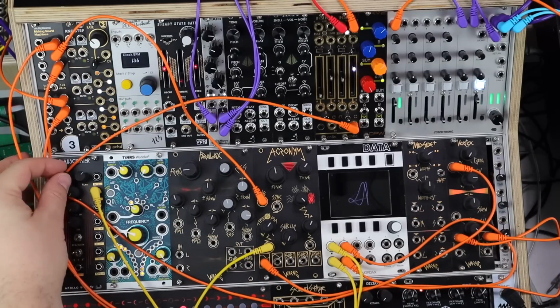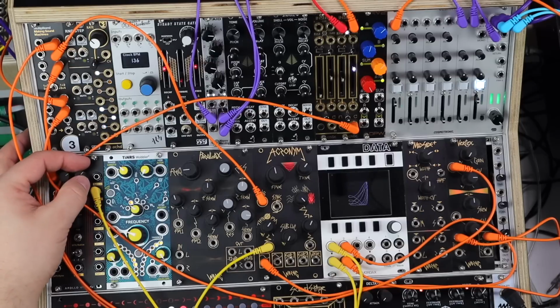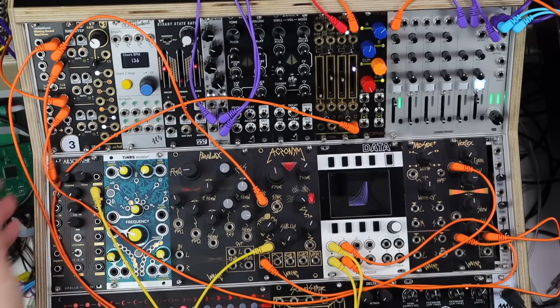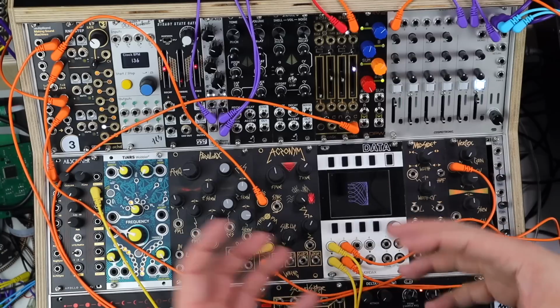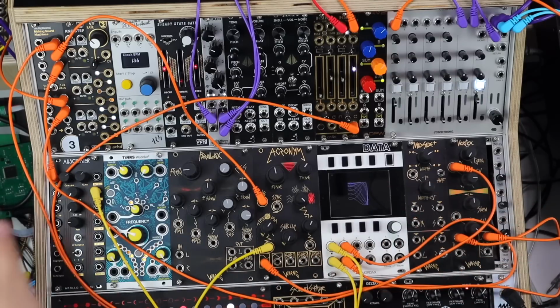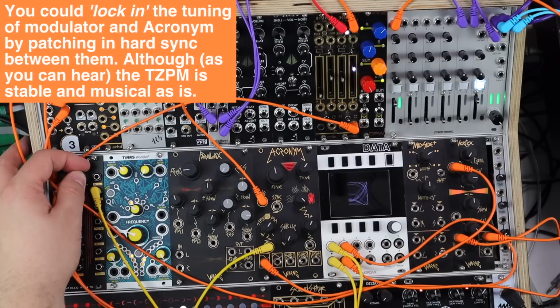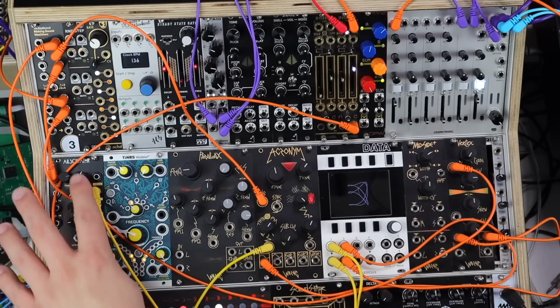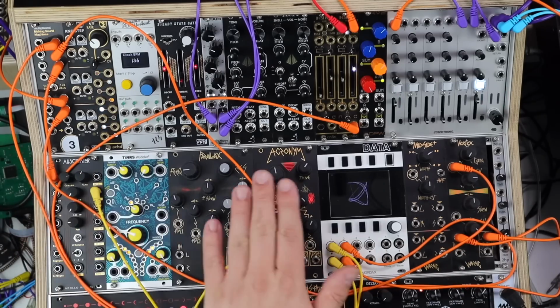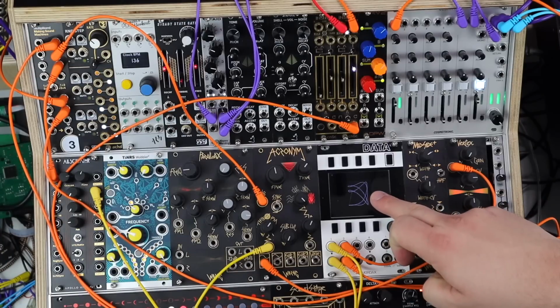Let's go to a high tuning. And even the outer tune, and you can see that beating on the Lissajous there, tones still give a musical result. This is the tuning more locked in, just fine tuning there. Both oscillators playing the same pitch sequence from a buffered mult. See, we get a really stable tone.